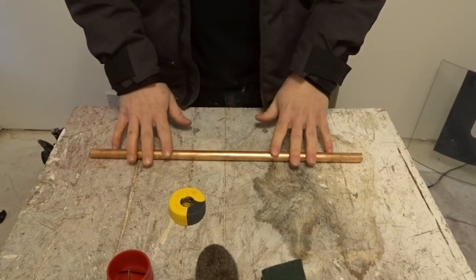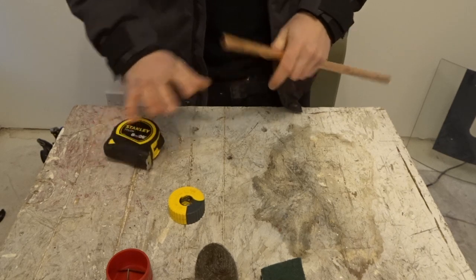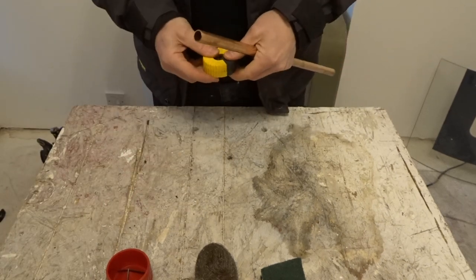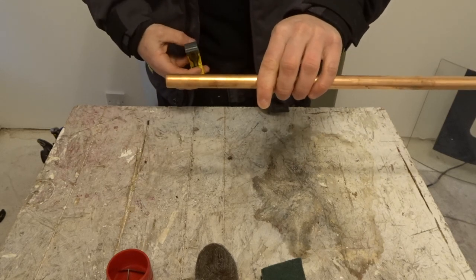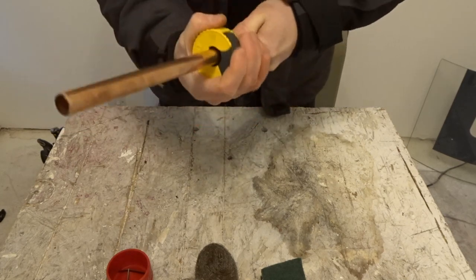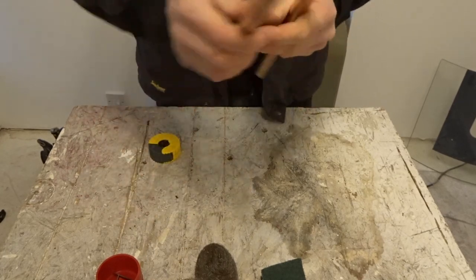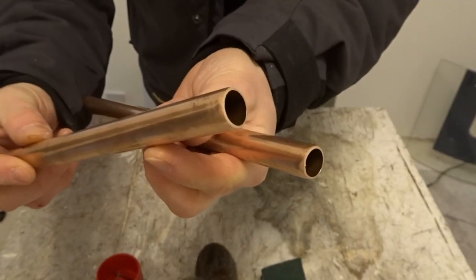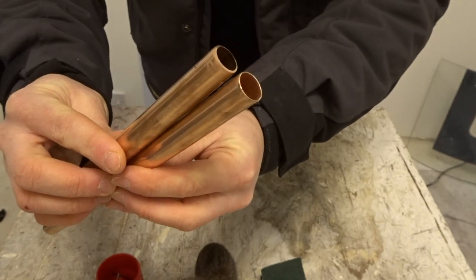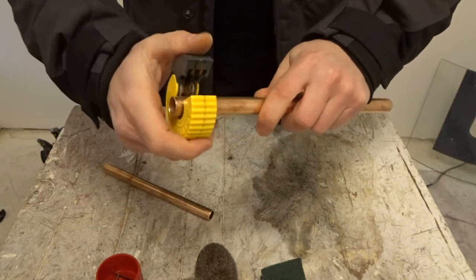So the first thing we need to look at is how to cut and prepare a piece of copper pipe. This will be dependent on whatever job you're doing, so a tape measure and a little bit of planning is going to come in handy. With your 15mm pipe cutter on 15mm copper pipe, measure off the length that you need, put that inside the pipe cutter, and rotate whichever way the arrow says — just keep turning and it'll drop off nicely. When you cut a piece of copper pipe you'll see a bevelled edge. New copper pipe doesn't have that, so even with new pipe you still need to cut the factory end off.